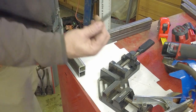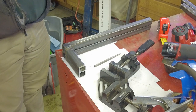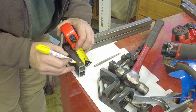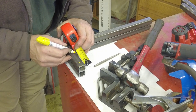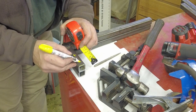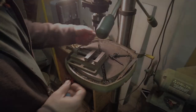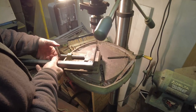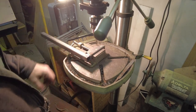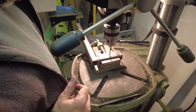There is more than one way to skin a cat, however — a good old-fashioned center punch and a nice big hammer. We'll come in from the end three-quarters of an inch and put the other one at two and a quarter. We'll start off with an eighth-inch drill bit. I'll center the hole over the slot in the vise so that when I drill all the way through, it doesn't screw anything up. We need a little bit of lubricant on there.